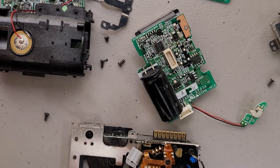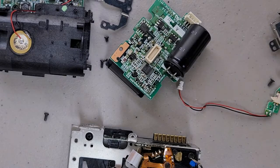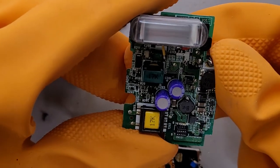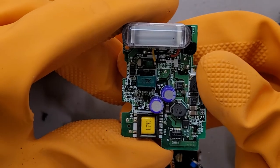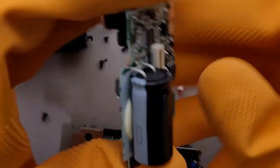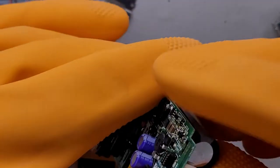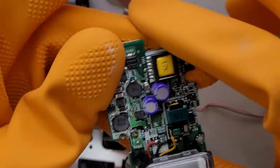Alright, I've gotten it torn down a little further. This has no charge on it, but I did try discharging it with a piece of metal with these cheap dollar store gloves — probably not good enough for whatever voltage flashes run at, but it makes me feel a little safer. This flash assembly is a lot more complicated than the Canon one I tore down that shocked me. It's a removable module, which is kind of cool, even though I don't think any of this is meant to be serviceable. I'd like to see what the capacitor is, but it's glued down. I think it's 320 microfarad based on what I can see from the side.